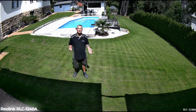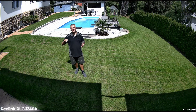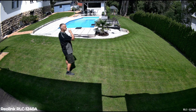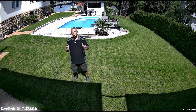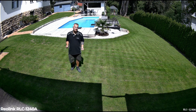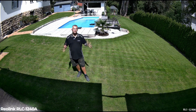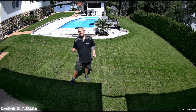After consulting with Reolink, I was informed that this is a fundamental issue with dome cameras. As long as the lens inside the dome is aligned at 90 degrees, there are no problems — the lens is shielded from the dome by a rubber seal. But as soon as you move the lens a bit to film at a slight downward angle, you get this reflection. So what does that mean? If you place great value on color night vision and want the LED spots to illuminate the area for color recording, then this camera isn't for you. If black and white recordings at night are sufficient — and you've seen the sample images in this video — then this camera is definitely a very good option.